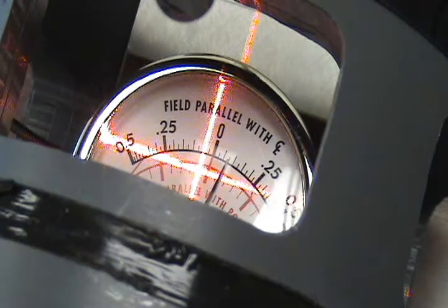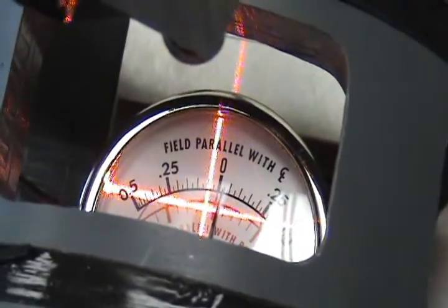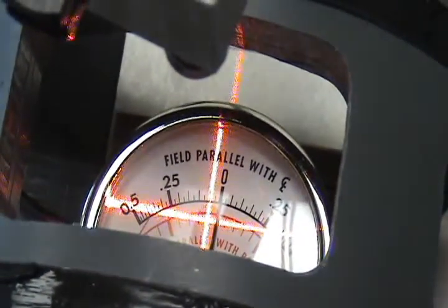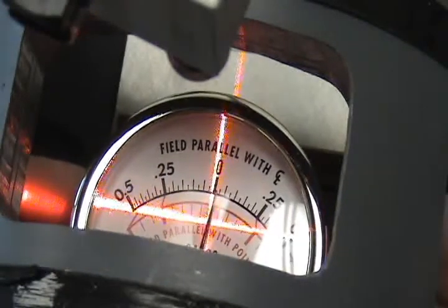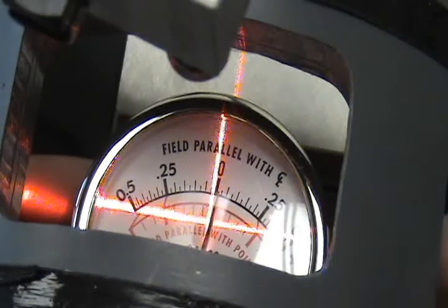Although a compass may be used for coil alignment, we are going to demonstrate this technique using a Lakeshore model 450 gauss meter set to 1 milli-gauss resolution so that a very fine resolution may be seen. As can be seen in this view, any slightest movement of the meter under test affects the reading. Proper alignment relative to the coil is crucial for repeatable results.